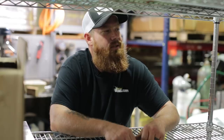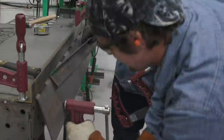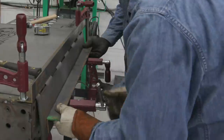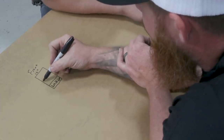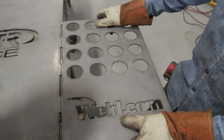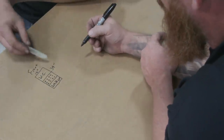We're going to try to build as much of this out of a full sheet as we can — we can bend the bottom parts in to kind of meet in the middle. Building it out of eighth inch material — a 4x8 sheet — doing all our bends out of one sheet. Up front we'll have our dual weld.com logo, and in the adjacent area we're gonna have our filler metal storage for different rods. We'll lay that out once we get over to the machine.